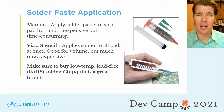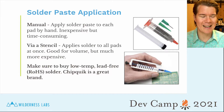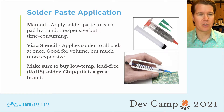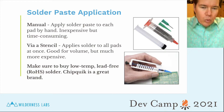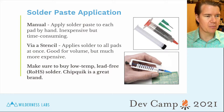We do most of our stuff by hand. Unless you're doing volume production, it doesn't really make sense to bother with a stencil. By hand is super inexpensive and it's not hard. Either way, make sure when you're purchasing solder for your assembly to get low-temp, lead-free solder. Low-temp because it's a lot easier to work with and there's less chance you'll damage components during reflow. Lead-free because you don't want lead in your system — it gases off when reflowing. ChipQuick is a great brand we use; it's easy to find on Amazon.